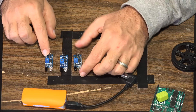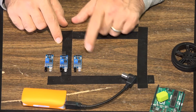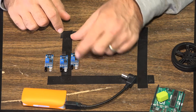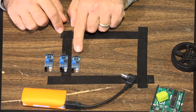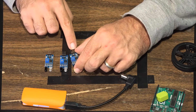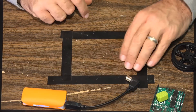We have three basic infrared proximity sensors. They should cost a dollar or two if you pick them up from Amazon — I buy them in 10 packs. You need the three-pin infrared sensors: one pin is VCC (voltage in), the middle is ground, and the other is the signal output.